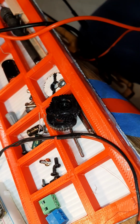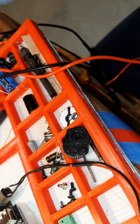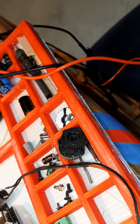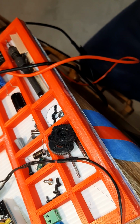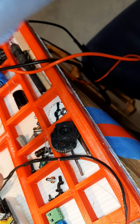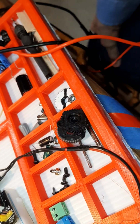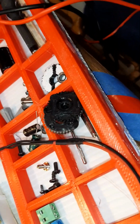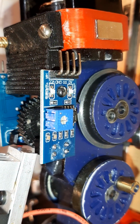That, I think, means I could run on a common ground with separate power supplies and be okay. If I brought in a 5-volt supply from the tender, these two circuits could run on that common 5 volts and the separate triggers. Now I got to wire up the triggers, and the good news is they're ready.